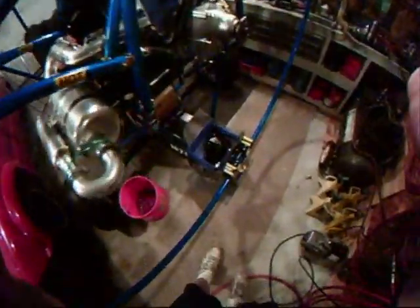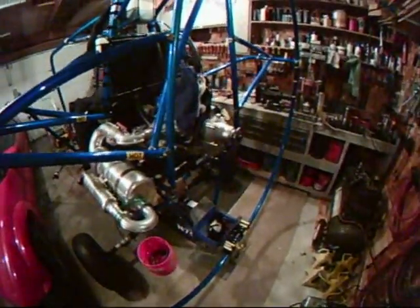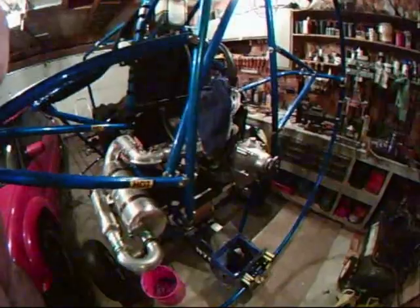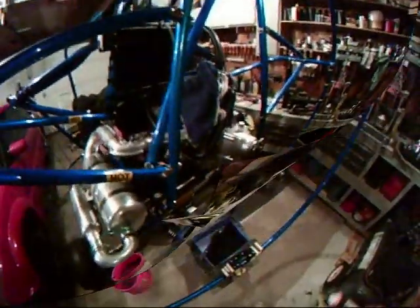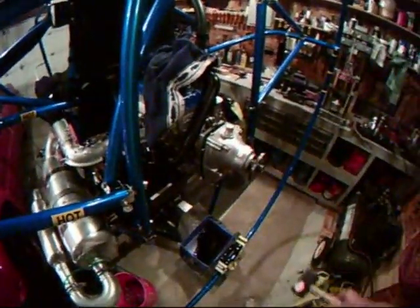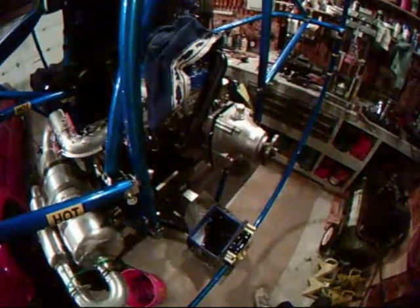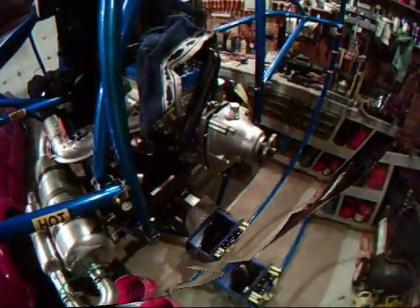Once the gearbox has been drained of all oil, you can start by removing the bolts on the gear half case. Take all those out, and we'll separate the case with a rubber mallet. The case is now separated, using the rubber mallet to lightly tap on it and break it loose. Let any additional oil drain from the system here, and then we'll remove the half of the gear case.